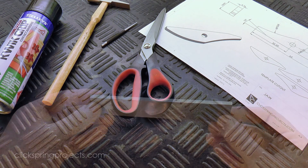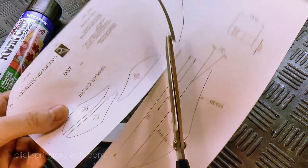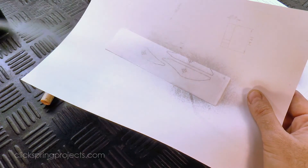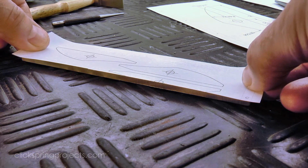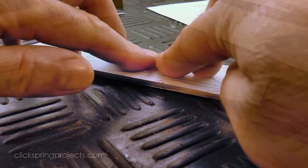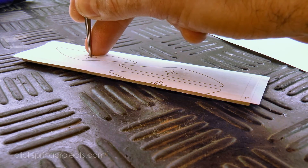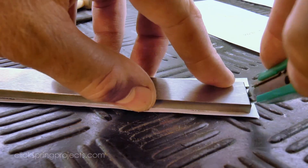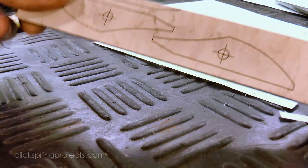Starting with the raw stock, I'm using a printed template to simplify the task of bringing the workpiece to the line. It's a simple method that gives both the perimeter and the hole positions with a fair degree of accuracy, and it removes the difficulty of laying out the design on a small piece of stock. If a good oil-based glue is used, the grip on the part is usually strong enough to see the template stay in place all through the forming process, although it will eventually lift if it experiences too much heat. So when shaping the perimeter with something like a belt sander, it's important to not let the work get too hot.